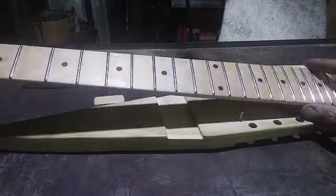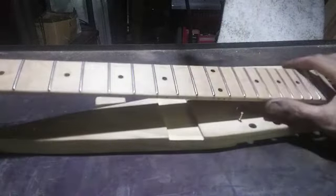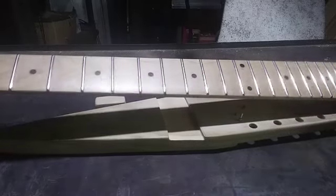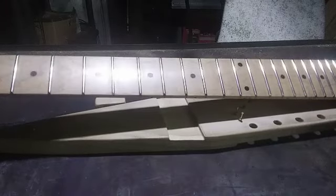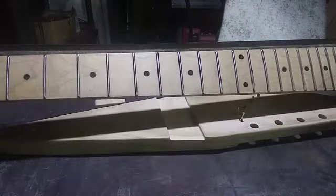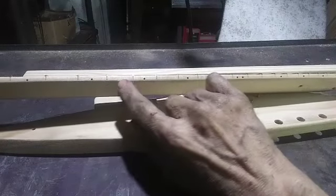And so while I was sanding the neck, I just sanded the ends of the frets at the same time, and that of course left some scratch marks, which I then used the erasers to remove. And it actually did a pretty good job. If I go to polishing compound, that could take it one level better, but I don't want to do that until I've got stain on this thing, because the polishing compound might interfere with the wood taking stain if I get, you know, compound down in here.